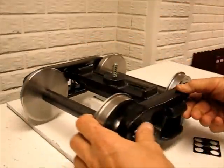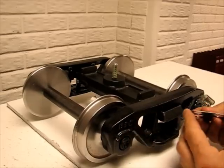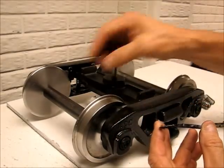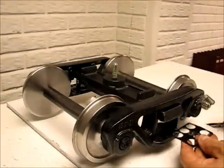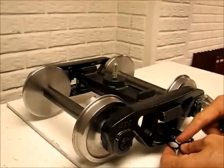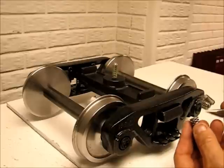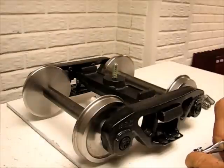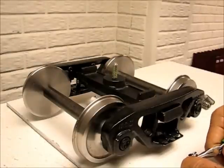Okay, now we'll put the second retainer plate in. Once again, notice that the retainer plate has an arch in it and the nub on the top. Three holes go in the back, three in the front. We'll lock onto the spring again. You have to lock onto these pretty tight. You'll have more trouble with these two springs than the other 12.